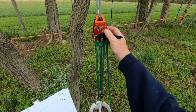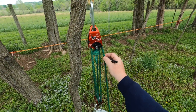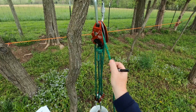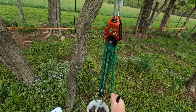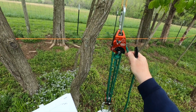Hopefully this makes sense. Over time you'll develop an eye for it — I can immediately look at this and go, oh, it's a four-to-one. Basically your top strand is a change in direction pulling down opposite your load. The load's going up and this is going down — that's a good indication. This is just a change of direction at the top.